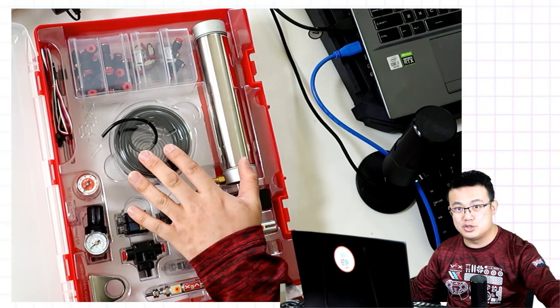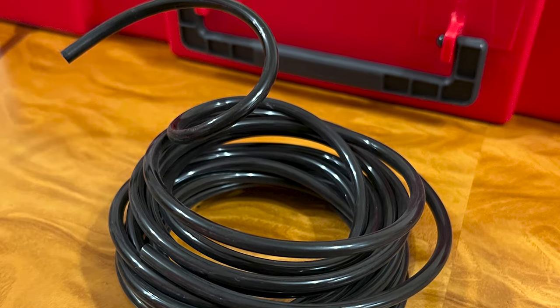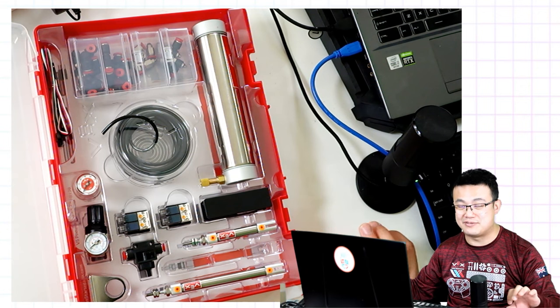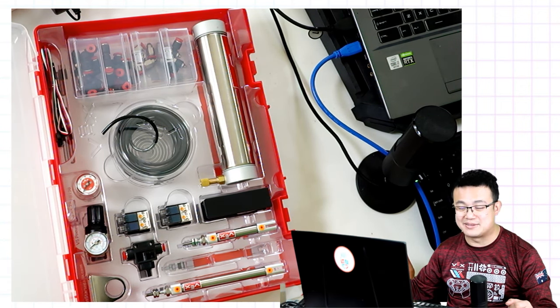This is the pneumatic tubing. This tubing redirects the air from your canister throughout your system. Make sure you only use the tubing that is necessary. You don't want to have it too long, otherwise it will use unnecessary amounts of air.